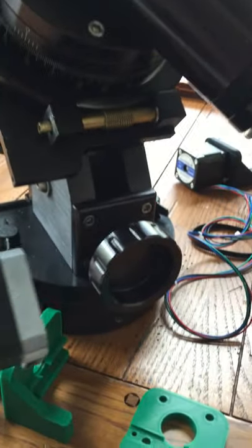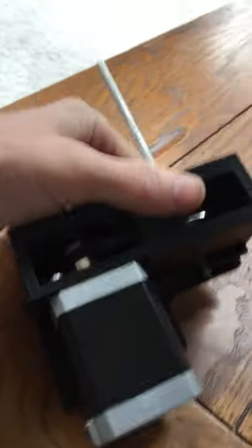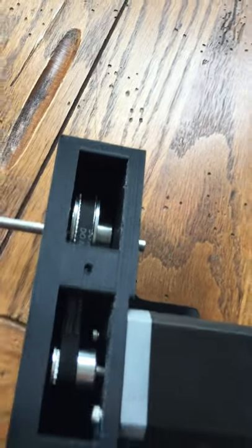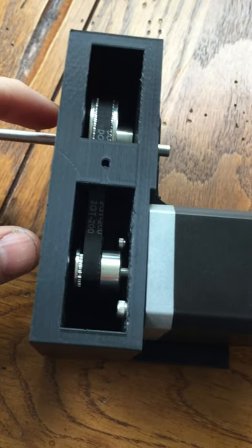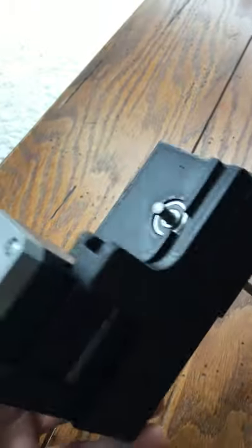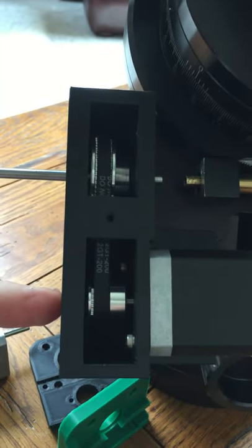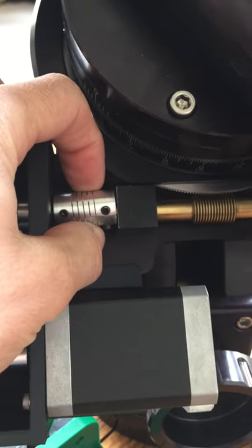With that said, I'm doing astrophotography so I really wanted to make this the best I could. I made this mount very similar to that design but added options for the motor — there's a 60-tooth gear and a 20-tooth gear on it, and this is a GT2-200 belt. You can buy the whole kit for about 18 bucks on Amazon, so dirt cheap. I've done a number of revisions but I think I've got it down. You just literally slide it right on here and it snaps in. The advantage is I get a 3-to-1 ratio. I don't know if the belt makes it smoother or not. You still have to have the coupling, but that's that.